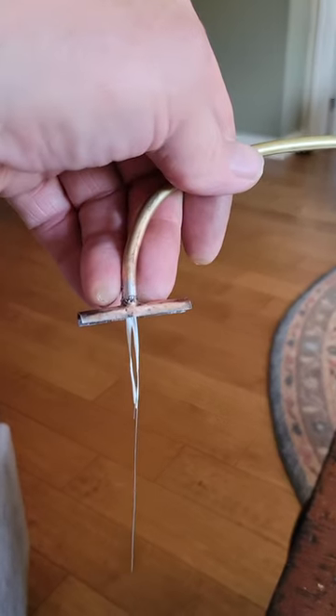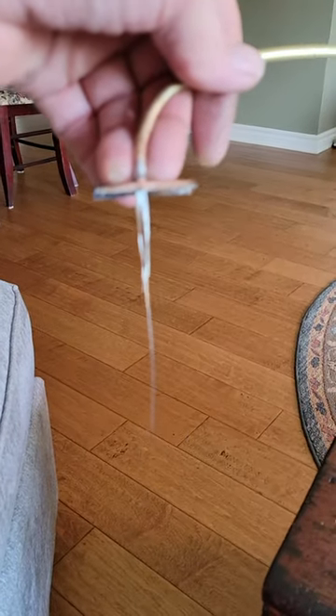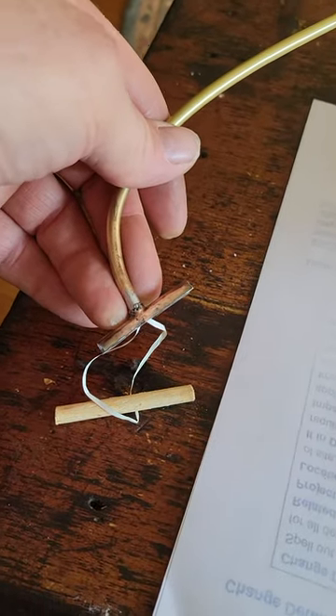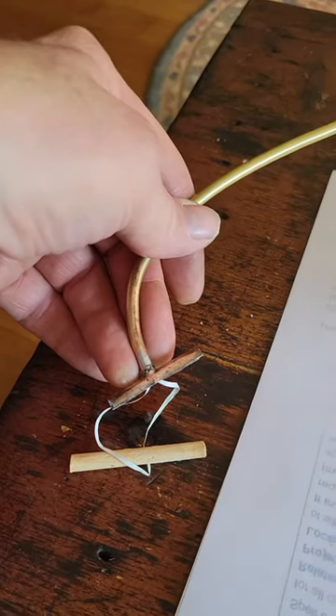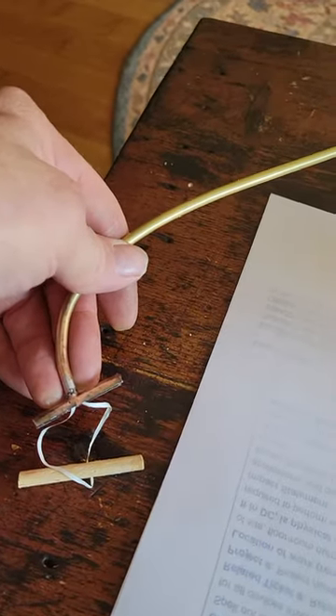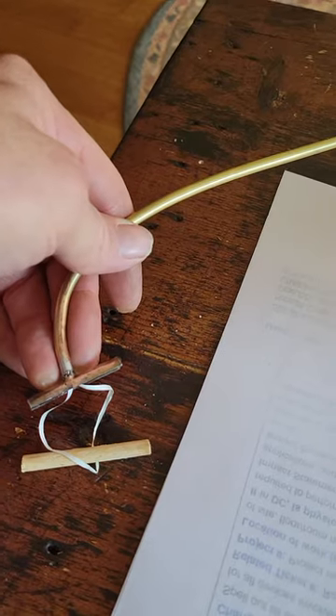What I do is hook the floss onto that loop on the E-string. The floss is pulled through, and I can set the E-string aside — it's done its job, ready for the next fiddle. The loop of floss goes around the pre-cut sound post. I'm just going to wrap that around my fingers and keep it taut while I get it inside the fiddle. These commercial rigs go for around $75 to $80 to install on the E-side F-hole.